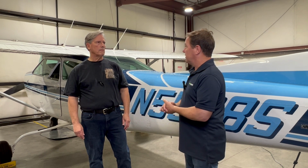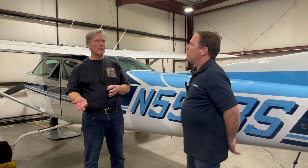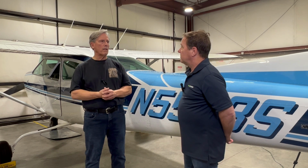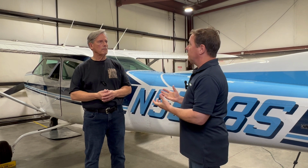Yeah, everything from more sensors to audible alerts along with those sensors, monitoring all 6 cylinders, monitoring all 6 exhaust temperatures along those lines. In a TR182, carb temperature is an issue because it's a carbureted O-540 that has a turbocharger added to it. You need to know what the carb temperature is, because you need to apply carb heat at the right times to avoid carb icing. Yeah, you almost have to be ahead of it, right? Yes. And now I've got that instrumented accurately. Great. Yep. Well, the other thing that we want to talk a little bit more about is exactly how you went around putting the equipment into the panel, and we'll get into that in the next session.